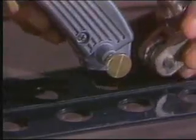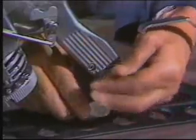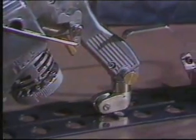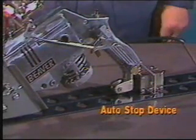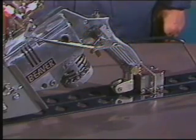When you want to switch back to unattended straight line cutting, you simply move the wheel farther out for greater stability and set the Beaver on the track. An optional auto-stop device brings the machine and gas flow to a halt when it contacts a striker on the rail. An optional beam splitter attachment allows you to move the torch to the front of the machine so you can cut very close to the beam flange.